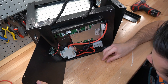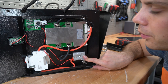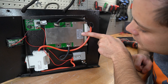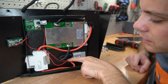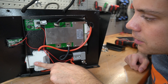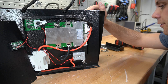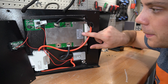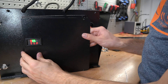This is a very simple design — a BMS, a high-quality circuit breaker, an Anderson power pole, state-of-charge indicators, and a beeper that connects to the BMS. This BMS is rated for 60 amps of continuous charge/discharge current and it's a common port. Something I don't like is these red wires don't have enough current-carrying ability to trip the circuit breaker — they should each have their own fuse. Also, the front of the battery says the maximum current is 40 amps, so they've derated the system with a 60-amp BMS, which is smart.